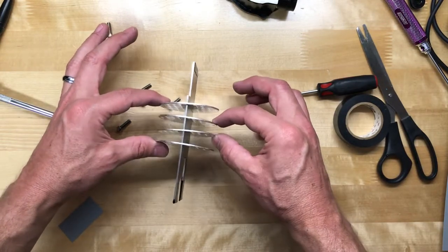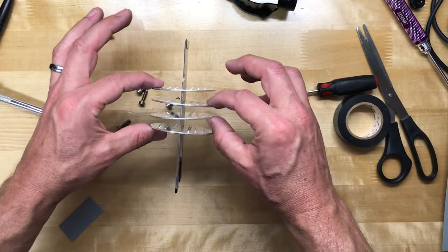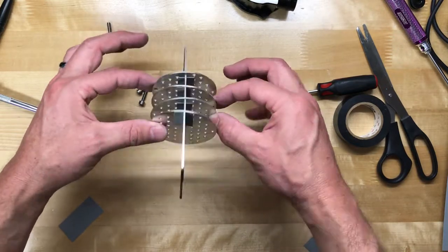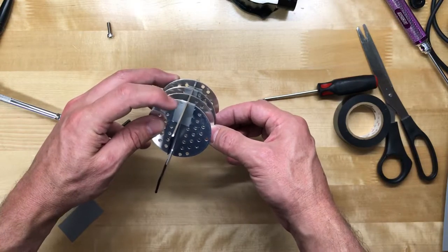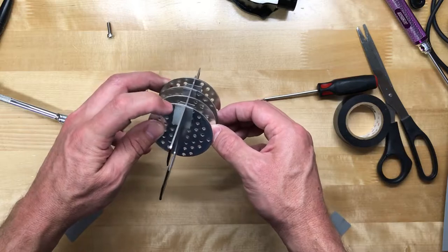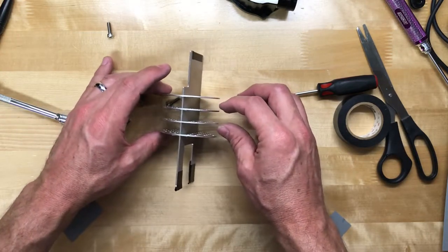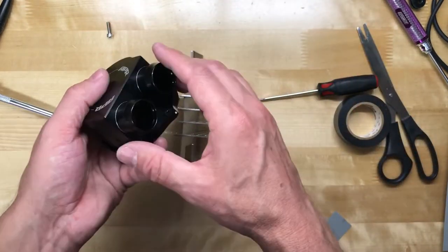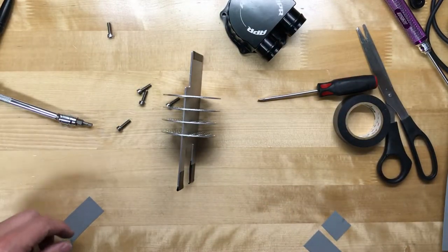Put pressure on them now, they don't tip nearly as much. So now there's the opportunity to also wedge them, which would then provide a mechanism to hold these little plastic tabs tightly too, to keep them from coming out. I think I might do that. I just don't want to risk something coming out, somehow making it all the way through this hose and getting sucked in the turbo.